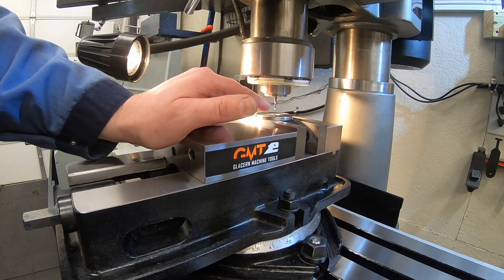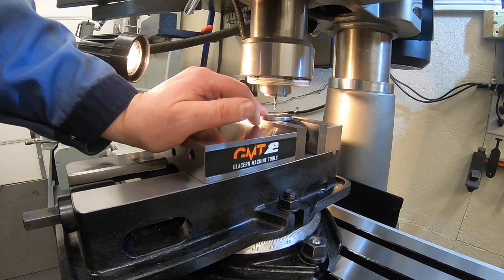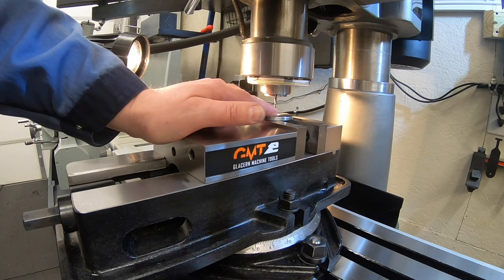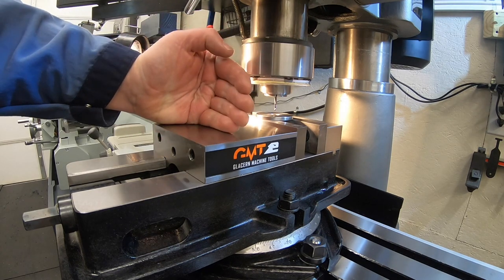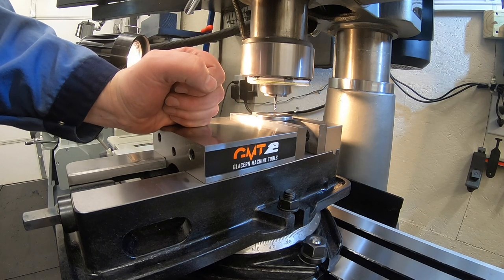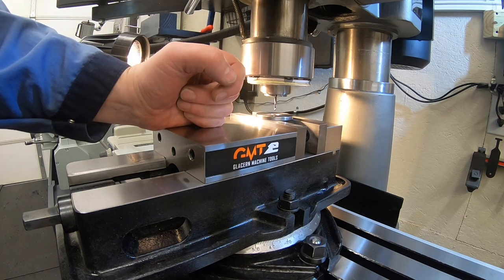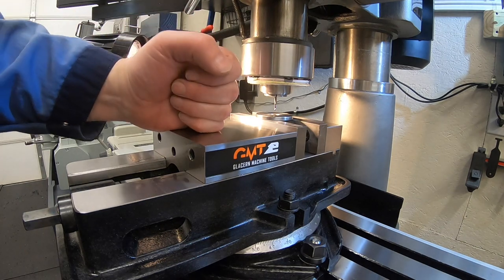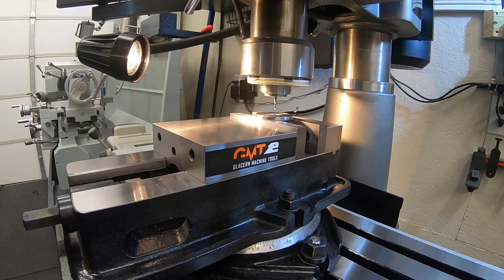It's actually a 7/64th keyway, not a 1/8th keyway. I had just kind of quickly measured it before, but went back and remeasured it. So I've got a 7/64th end mill in there. I'm gonna touch off on the outside of that radius, and then I'm gonna move over 109 thou, the full diameter of that end mill. So half of that is gonna get me to where it's just cutting in that radius, and then the other half should get me the depth that I need for the keyway. So once we do that, I'm going to come straight down 3/8 of an inch. After I'm down 3/8, I'm going to feed it out and just make sure that we leave nice square edges on that whole cut in there. Let's go in there and take a look. Very small cutter, so we are running at a full 3000 RPM, fast as my mill will go.